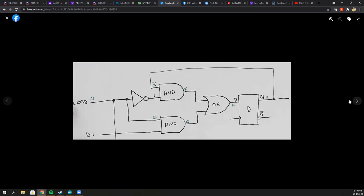Here's how the memory circuit works. With the load switch turned off and the D flip-flop already containing some data: a zero on the AND gate always gives a zero; that zero gets inverted to a one; whatever data is in the D flip-flop gets recycled back. So the output is always that stored data. As it passes through the OR gate, you get back the same data cycled back to the D flip-flop — that's how the data stays intact.